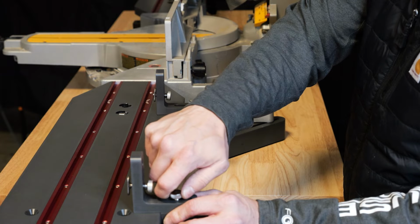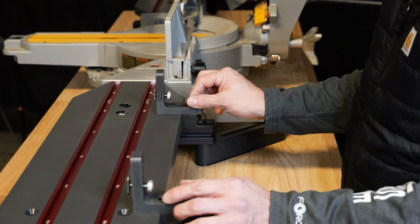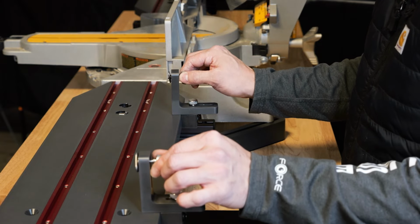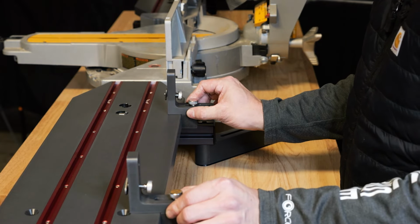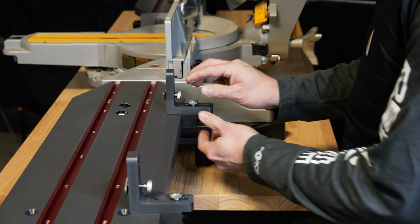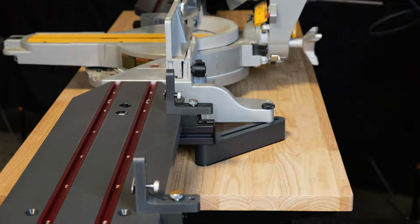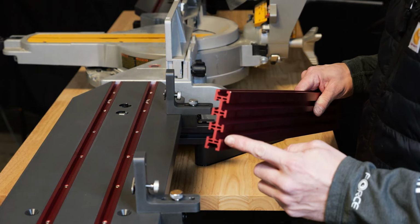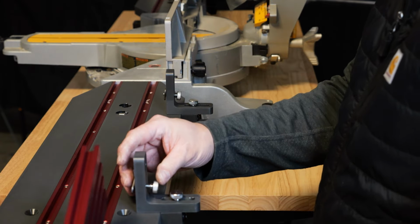to the mounting blocks. Notice that the slots within the fence bracket allow you to precisely position the fence brackets wherever you'd like, and allow you to slide the fence forward and backwards and up and down as needed. Once you have the brackets installed, then it's time to add the extruded rail back fence. Within the fence, you'll notice that there's 3 different tracks, each of which you can index the fence brackets into depending on your own need.